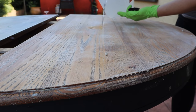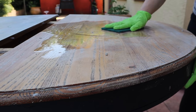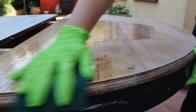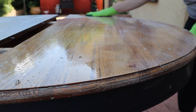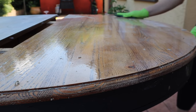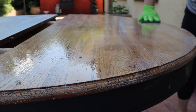I need to neutralize this chemical stripper. So I'm going over it with some mineral spirits and a clean 3M pad and I'm going to scrub the entire piece. This is going to help open the wood grain up, get all the residual off, and neutralize the chemical stripper — stopping what I call the cooking process, or the activation process.